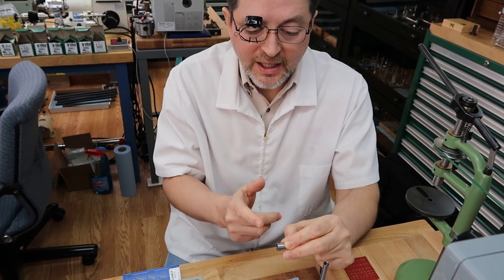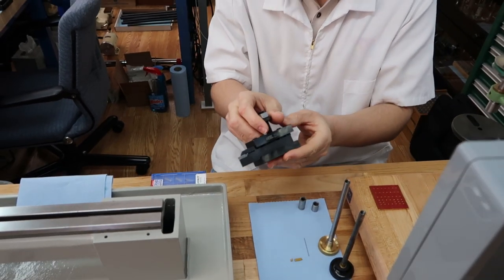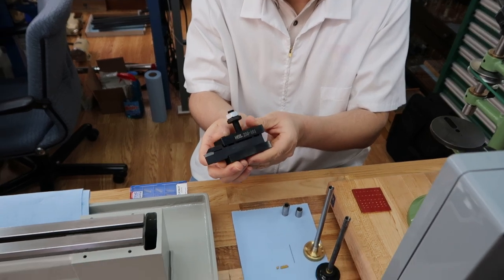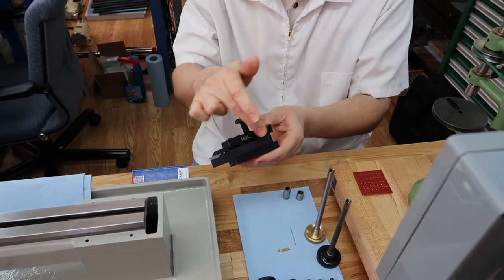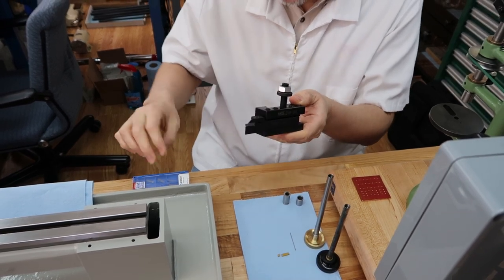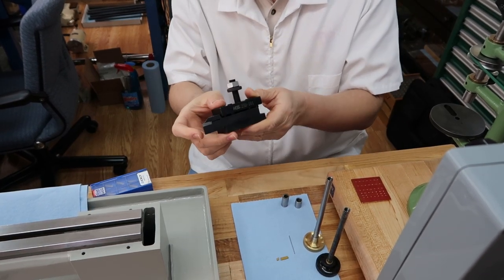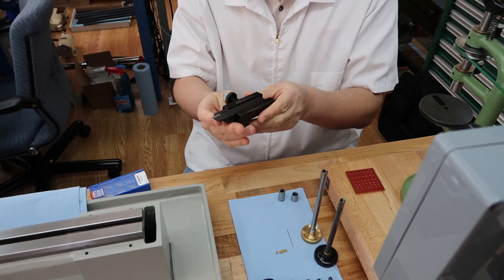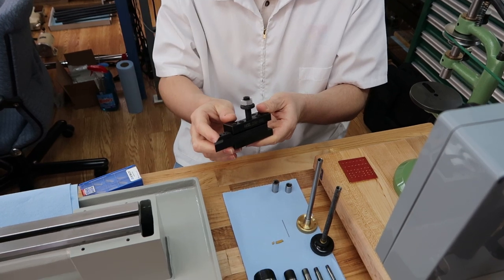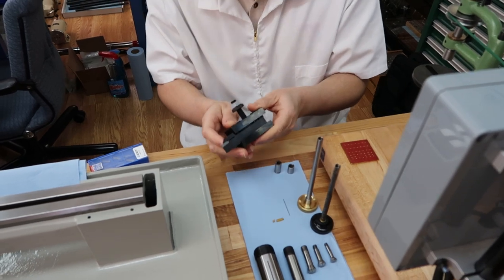The problem was when I went to cut it off with this cutoff tool. I've gone through a lot of different cutoff tools. I've used high-speed steel blades and different insert types. The inserts this one uses are MGMN, and this is such a great tool. I can cut off up to grade 5 titanium, no problem. It's just wonderful compared to other cutoff tools I've used.